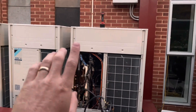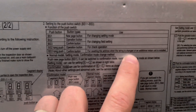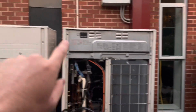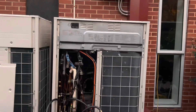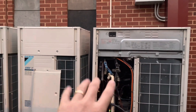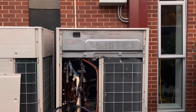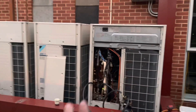I ended up trying to re-address everything. So if I pull this cover off I'll show you what I mean - up here you can see it says BS3, long push for resetting the address when wiring is changed or an additional indoor unit is installed. So I thought I could do that to get this unit to forget that 14th indoor head that had been removed. That didn't work, and it ended up losing the master and slave programmings as well. I then tried to put this into force master, force slave - that didn't work either. Basically nothing I was doing was working the way I thought it should.